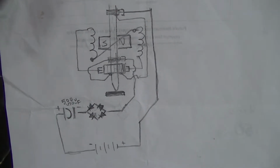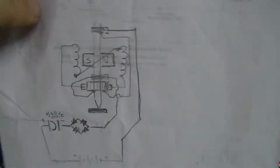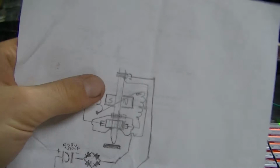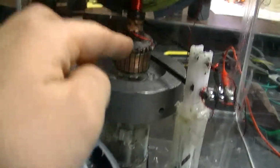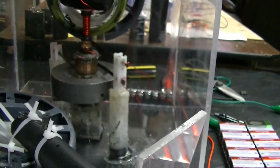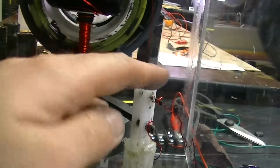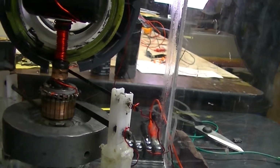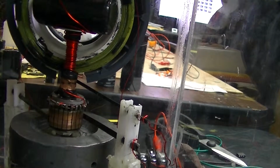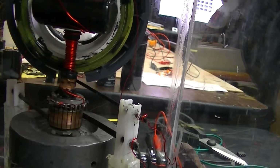And yeah, you can freeze that puppy if you want, but my suggestion would be don't do 2 slip rings. I have a copper flashing kind of as a slip ring with a brush to it, and I would suggest not doing that because it needs to run through the core here. And also I think I'm gonna get rid of these brushes and actually just wrap some copper wire around there. It'll probably hold to it a little better.